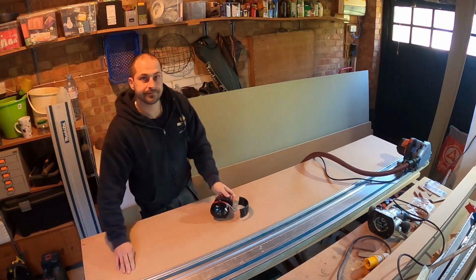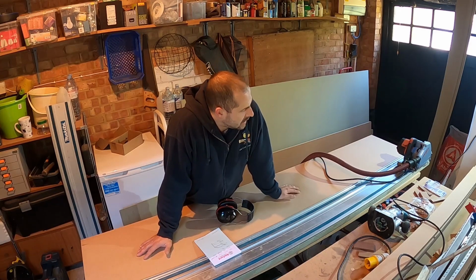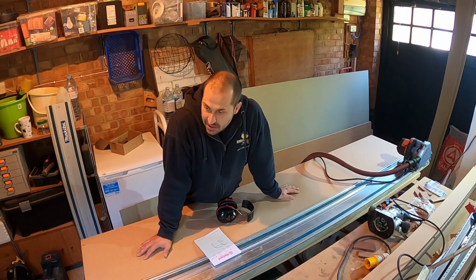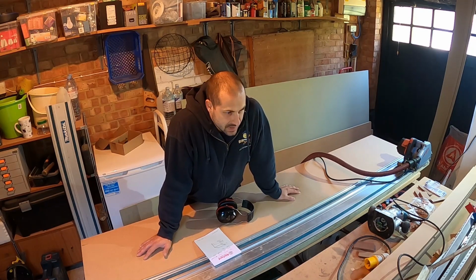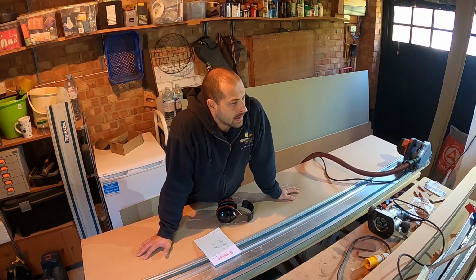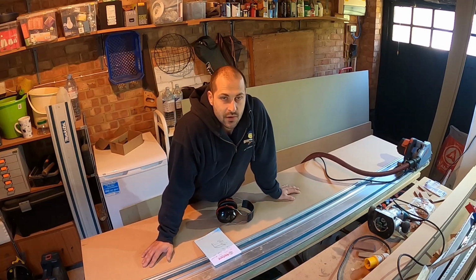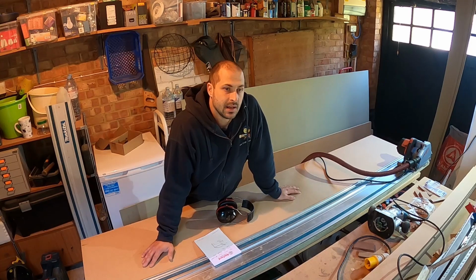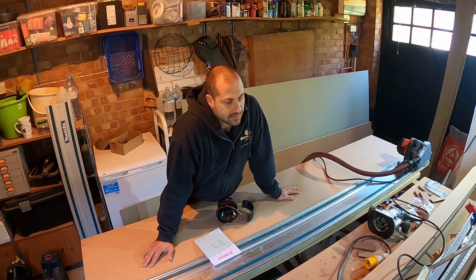What I would suggest when you're cutting for your units, first of all, if you can, request sheets being cut in half lengthways. It will allow you to struggle less, a more manageable size, because quite often when you do units, you don't have a space to really do it, and if you've got an 8x4 sheet, you want to turn around with it and whatnot, it just won't work out. It's heavy as well, it's about 40 kilos, so that's another thing.